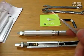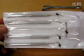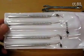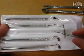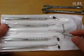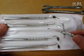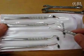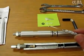These dental tools can be had relatively inexpensively from Harbor Freight. This kit here from Harbor Freight's about $4, and it's a nice investment. We used the straight one from the center here and bent the end over, and we ground it off until there was a little more than an eighth, a little less than a quarter hook on that. And that's what we use to pull the O-rings out. Just make sure you take the point off and you make a nice rounded edge on that.